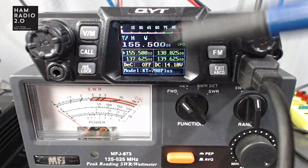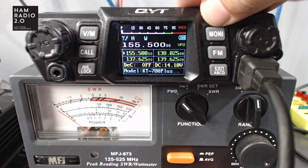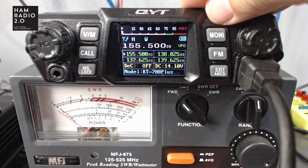The four bands in green beneath the VFO on the screen will apparently allow you to monitor four VHF FM frequencies at the same time. So if you're listening to multiple repeaters — say you want to keep 146.52 on constantly and also listen to two or three different repeaters simultaneously — that's a neat feature, though kind of weird to see on a monoband radio.